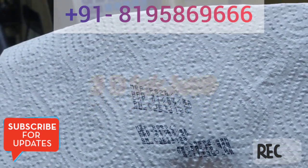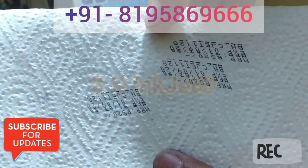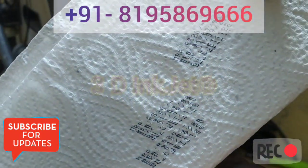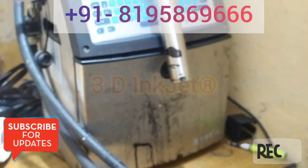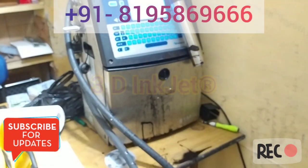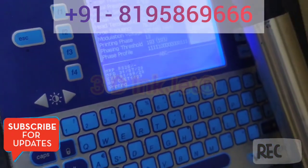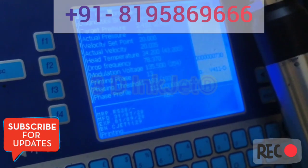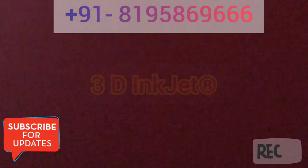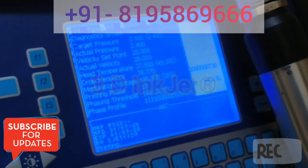The print quality is not good right now. The ink is mixing up, the bottom line is cutting down, and there are many problems in this machine. The machine nozzle is not okay, and the ink velocity is very low compared to the required machine parameters. The modulation voltage is very high, the target pressure screen is coming down, the actual velocity is also stable, and the head temperature is 43 degrees — it's continuing to rise. This printer will be okay after some time of running.